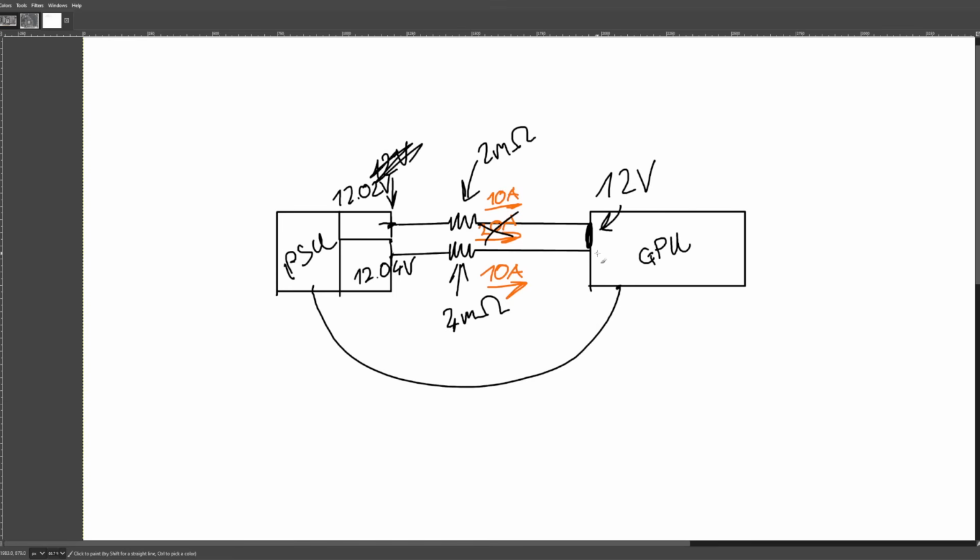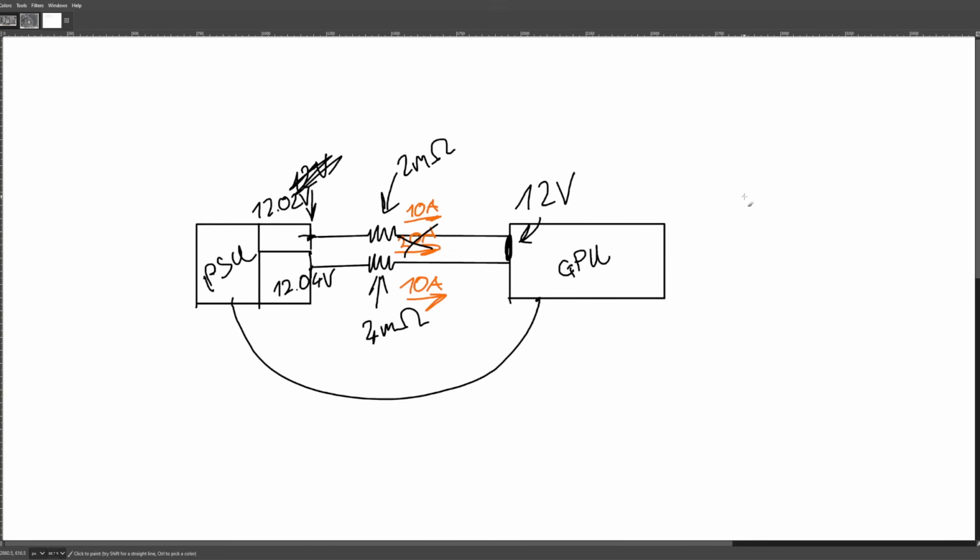I think the better solution would be a power connector with more headroom and laxer power limit enforcement. Because I feel less bad about overloading an 8-pin power connector, since the 8-pin has so much safety margin. Oh yeah, the Vega GPU might sometimes pull a little bit too much power from one of the 8 pins, but the 8-pin has so much margin that it just doesn't matter.